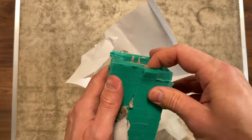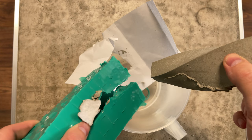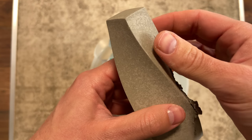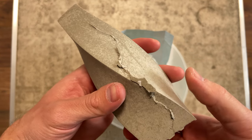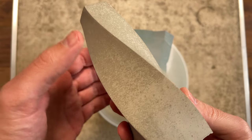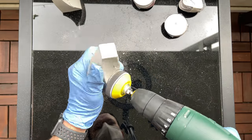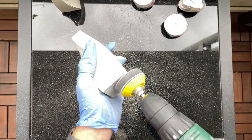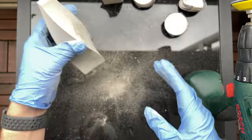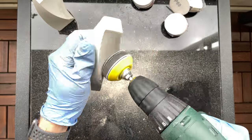Now that we all learned that, the third run worked like a charm. That tiny hole in the mold caused leakage. I had hoped it won't be as much, but it is what it is. Hence, we unfortunately need one more additional step. We have to grind it down as much as possible while keeping the initial shape. My battery is not very strong, so I left a little bit of a seam, but still I think it looks great overall.